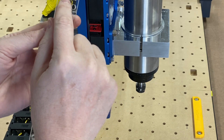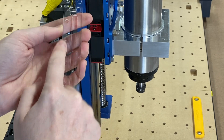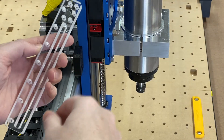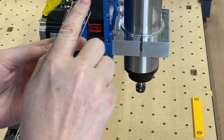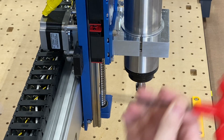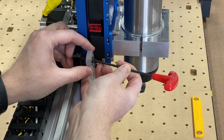It does not matter which holes you put them into — well, sort of. You've got two holes up here at the top, and then two corresponding holes just below it on the third row. These two holes here are for accessories — whatever you or I think up. These holes down the side are also for accessories. In some of my carriages I do utilize the bottom hole, but the rest are for you to use, either mounting a spray tube or whatever. I would recommend using at least one on the left side and one on the right side, just to prevent any sort of twisting. So we're going to take our M3 hex driver and we are going to be threading this — go real slow, because you could strip it out.